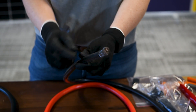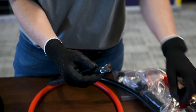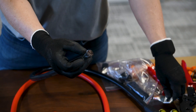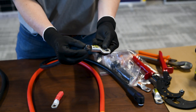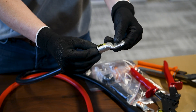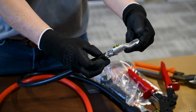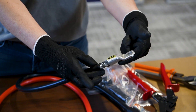Applying the lug to the ultra-fine wire is slightly different because, as you can see, the fine wire makes it a lot harder to get it into the two-aught lug. One of the tips we recommend is to go with the next lug up. We don't sell a three-aught lug, but if you could find one that would be great. A four-aught lug is the one that we sell and recommend. You can get your ultra-fine stranded wire into the four-aught lug really easily, and it doesn't affect your ampacity or anything when you're using that. So we're going to use the four-aught lug today.